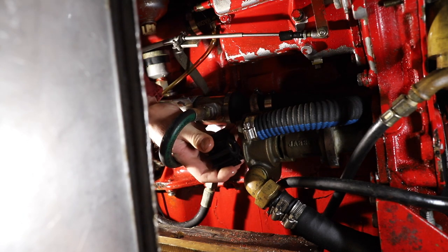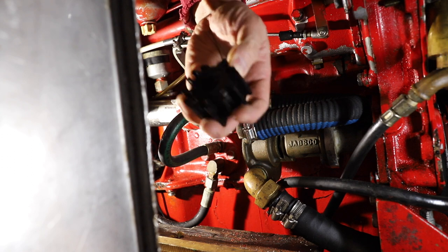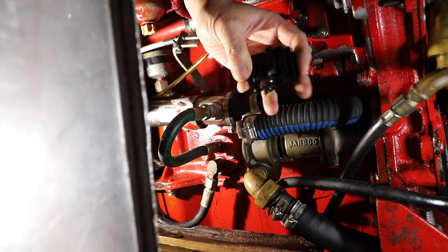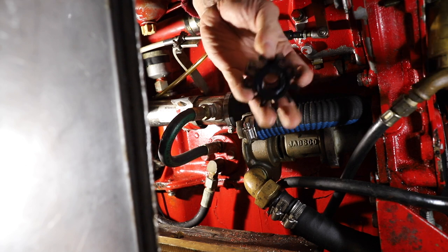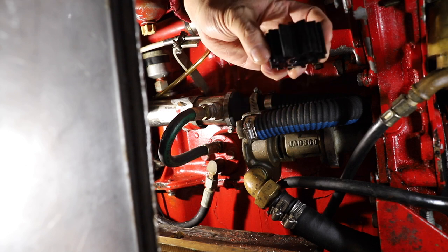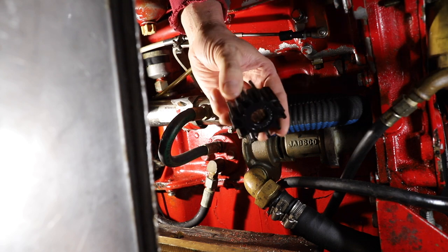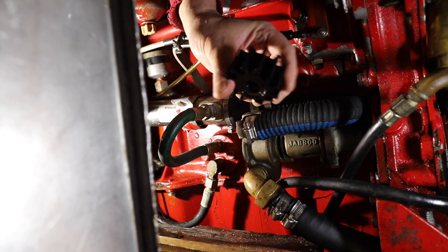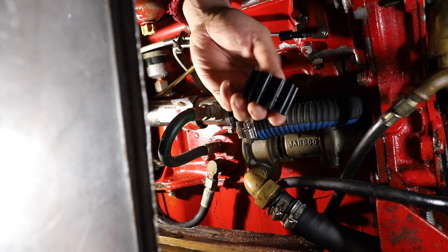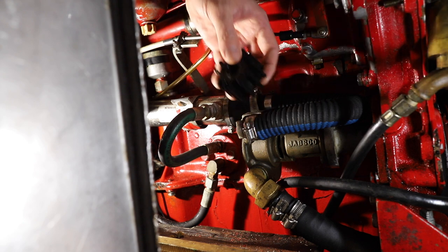Like that. And there's the impeller. And of course you should take it out for the winter, because after the winter it has to stay in one position and it goes like this, which is not good. But I already knew in the fall that I'm gonna change it to a new one, so maybe it's not that big of a deal. Yeah.